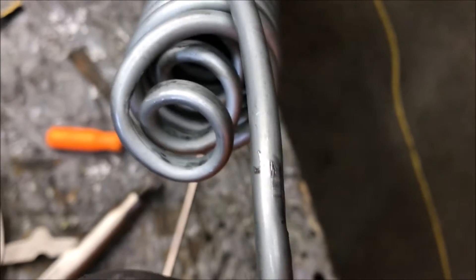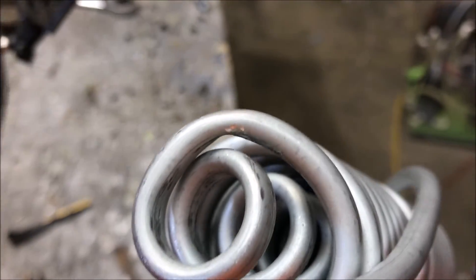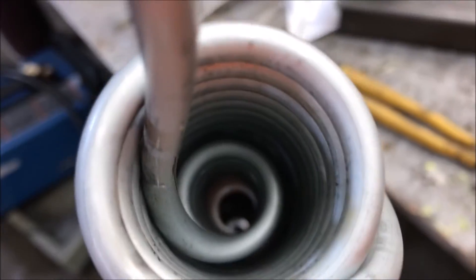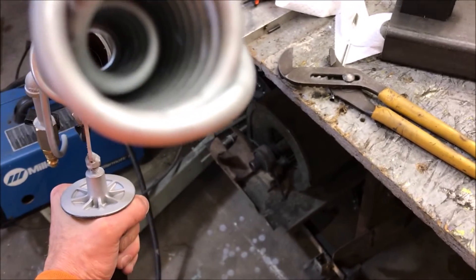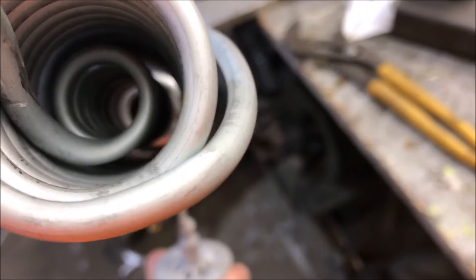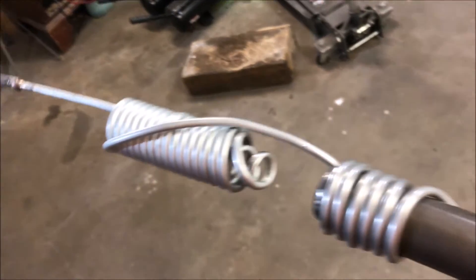Trying to get the camera in on it here. It got a little hairy in there — started to kink just a little bit where I wrapped around the second pipe, but it did not fully kink. See what I mean by the first sections of coil being flattened just a little bit? That's actually good for our purpose — we want to flatten the profile and increase the active surface area. That's how you bend steel tubing with water.